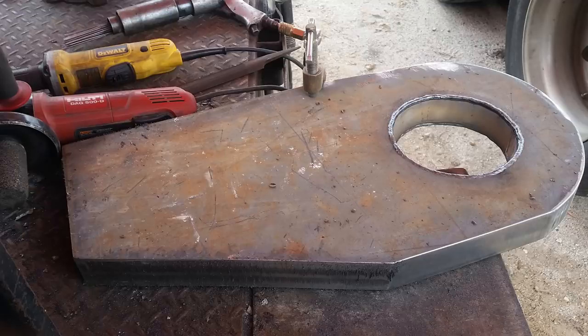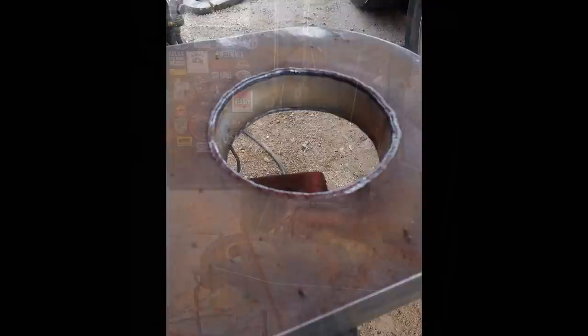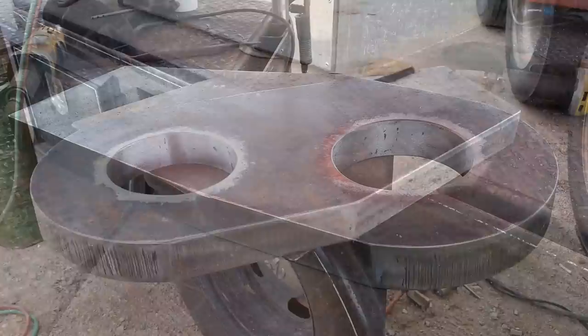So in a very similar way, around the perimeter of the piece I cut, I used a flap disc to remove any sharp edges or any nicks that could cause problems. That's a good sized chunk of metal. It's 2-inch plate. I think it was AR-400. I don't actually know. The material was provided by the customer. The front there looks like it's got some deep serrations, but they weren't deep at all. They were very shallow. So a little bit of cleaning with the grinding wheel, the grinding stone. Make sure all the edges were smooth. It almost looks like a factory piece.